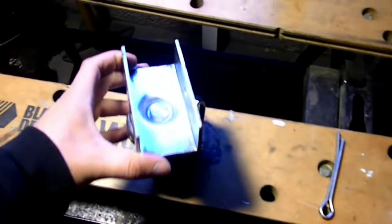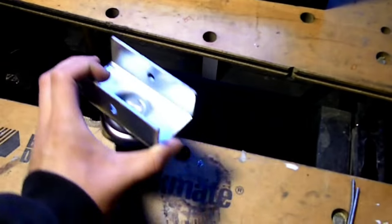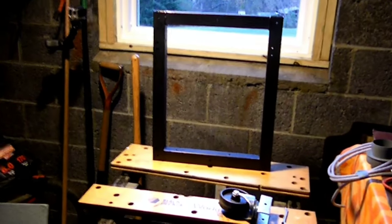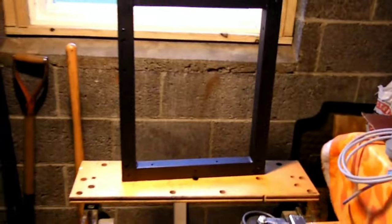And anyways, even besides that, most of the carrying capacity of the caster wheel is going to be this channel that it sits in here, not necessarily the cotter pin. The cotter pin just keeps it from moving up and down the frame. So I'll get myself set up and watch the assembly process. Oh, and the piece of plywood that I had already drilled the holes for is going to be held in with quarter-inch carriage bolts. So I'll grab those and see where it goes.